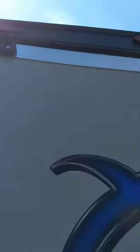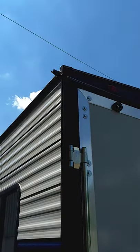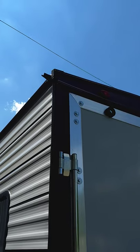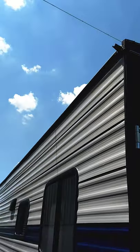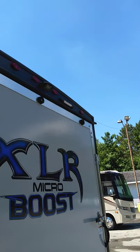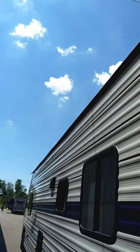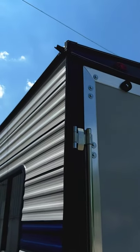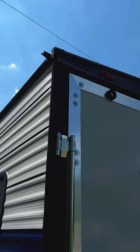You have to inspect your roof at least three times a season — in the spring, in the fall, and once in the middle of the summer. Walk around, check all the sealant on the roof, make sure it's good and tight with no separation or cracking. Odds are you won't have to do anything for a long time, but that's why you inspect it.